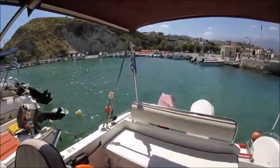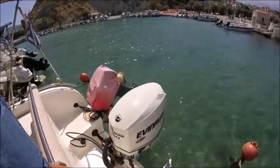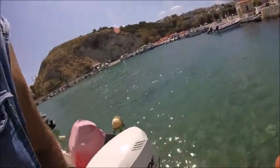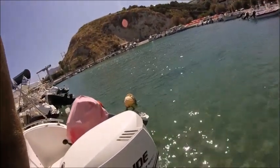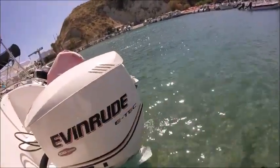and there's the engine started. Now what I do now, like I've said in other videos, is I just make sure that there's a jet of water coming out the end, which should start. There we are, you see that there, right just there, look. That means that the water's being flushed through the engine to cool it down. So I'll let that run for about 10 minutes now, just while I get things prepared and sorted in the cabin and getting organised, ready for a trip out.